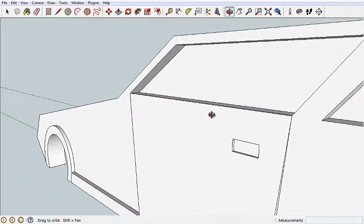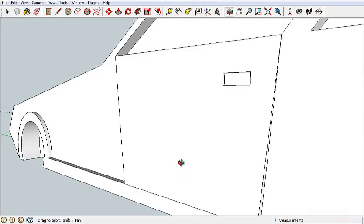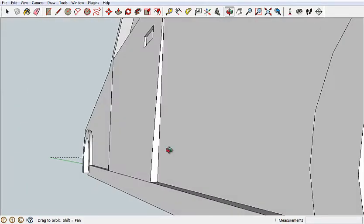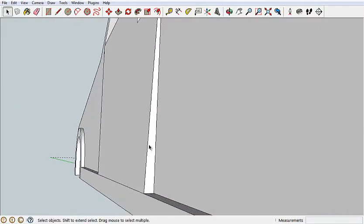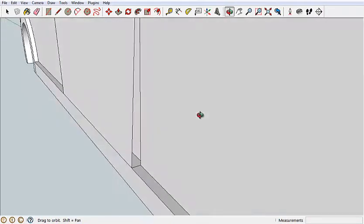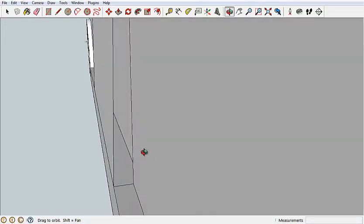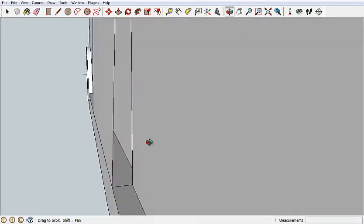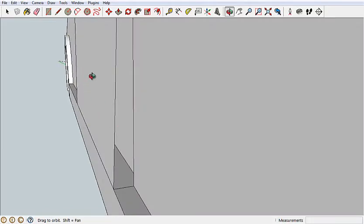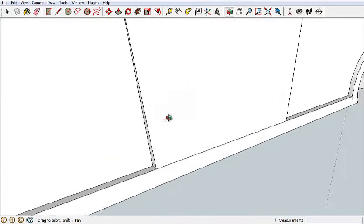So a few other things you want to look for just as you're checking your car before you print is any gaps or openings in the design. Usually this doesn't happen, but every now and then you may see something like this, where at first glance it might look like everything's fine, but if I look at this closer, we see that this is actually an opening in the side of the car, which is not going to print well because it's going to try to print this edge with nothing behind it, and there's going to be some problems with that print.